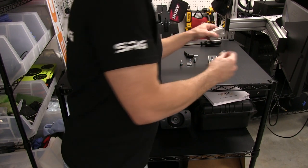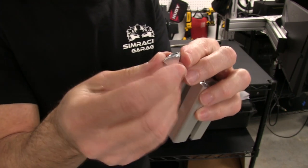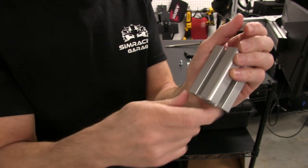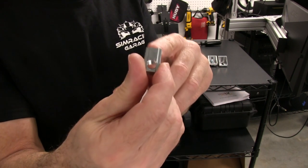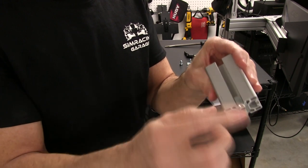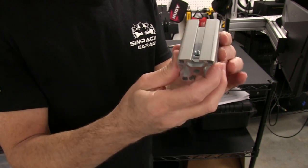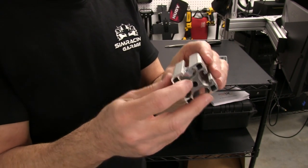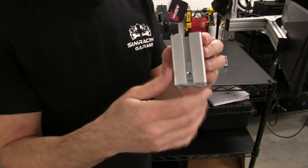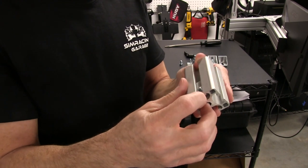I'll show you how the spring ball actually works. You can see grooves on this T-nut and a raised area in the middle that's the same size as the channel. When we slide this in, the two little grooves on the sides — the wings — grip the profile and once you slide it in, it won't come out. With economy nuts, they slide in and out easily and if you tilt them at any angle they'll go running out on you and you'll lose your T-nut. So it's great to have the spring.